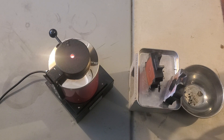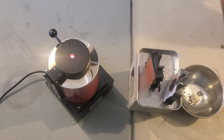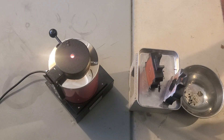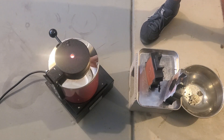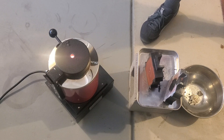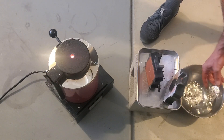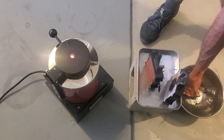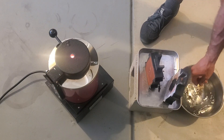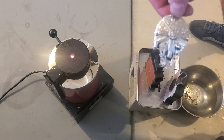You could arguably find a place outside of the furnace to let your graphite crucible cool down, however I just have kids running in and out of the garage, so the safest place is just keeping it in the furnace. Otherwise, if you can find a nice concrete area or area surrounded by bricks, that could be a good place to allow your crucible to cool and prevent a little bit more breakdown. Once you're really done with the pouring process and your furnace is cooling down, any additional breakdown should be relatively minimal.